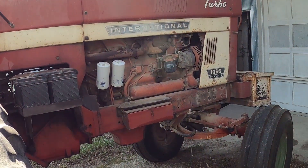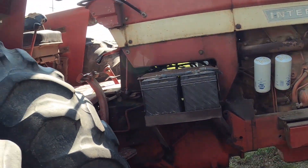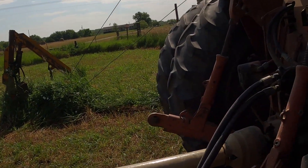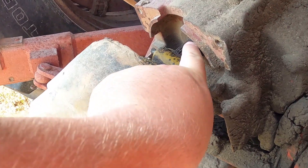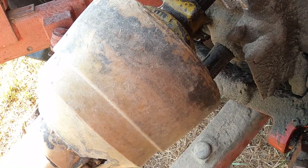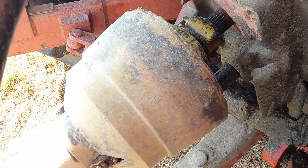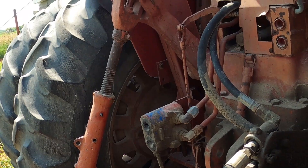We're running this on an International 1066. I think she's about 100 horse, if I remember right, maybe a little more. She's old, but she works pretty good for the most part, especially for this. Internationals have got two power shafts — this is 1,000 PTO and that's a 540. You can tell by the splines: 1,000 has more splines, 540 has about half of them. There's also a big 1,000 PTO with a larger shaft on some tractors, but I don't think we have any that use those — maybe our biggest one does, but we don't use the PTO on that.